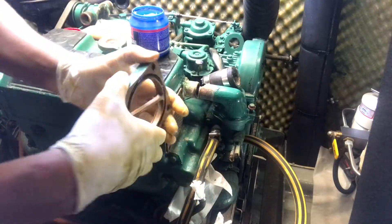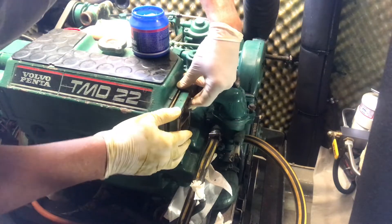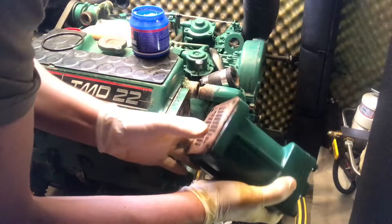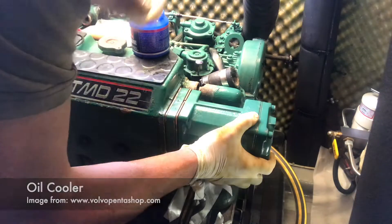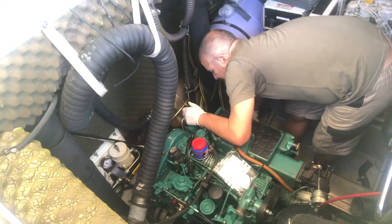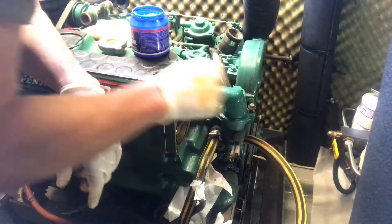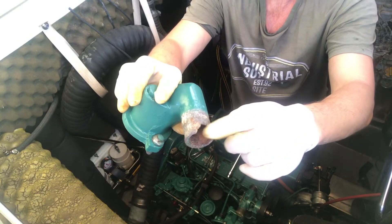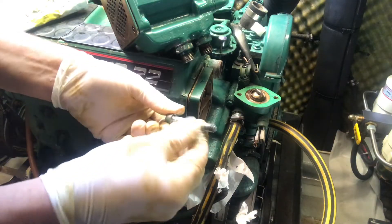Make sure that lines up, and then the oil cooler just puts up against that. In the schematic this was the wrong way around so I struggled with that. The bolts go in there but I've got to remove the thermostat housing here to get to it first, so I'll just put that back in place so I don't lose it. The thermostat housing is actually corroded away a little bit here, which is a bit worrying — you can see the corrosion there. This will need replacing further down the line, maybe not now but later. A little bit of Duralac on there just to stop it corroding.